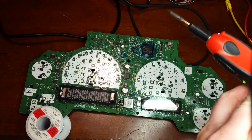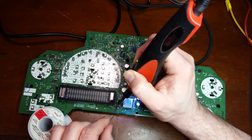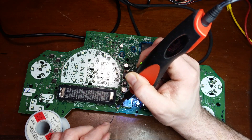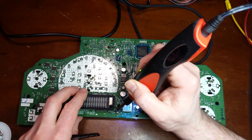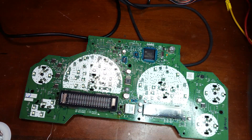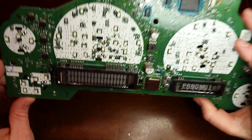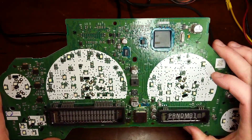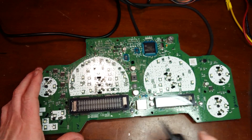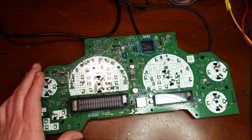Let's switch over to the big iron. When I first got this soldering iron, I was kind of disappointed — it was advertised as 60 watts, it's a Weller, so I figured how bad can it be? After getting it home I realized it's not really a 60 watt; in the fine print it says it heats up like a 60 watt. So it really doesn't have enough power for big connectors, but it's a good medium-sized iron. The solder joint looks a little goopy — a little excess solder compared to factory — but I'll give that a quick clean and then power it up to see if we've got to replace that driver chip.